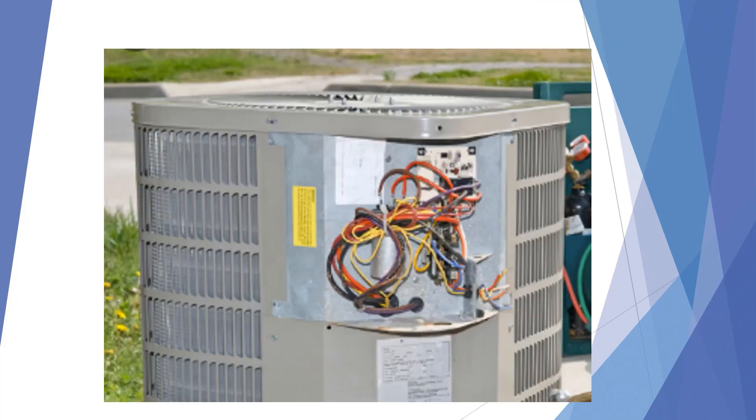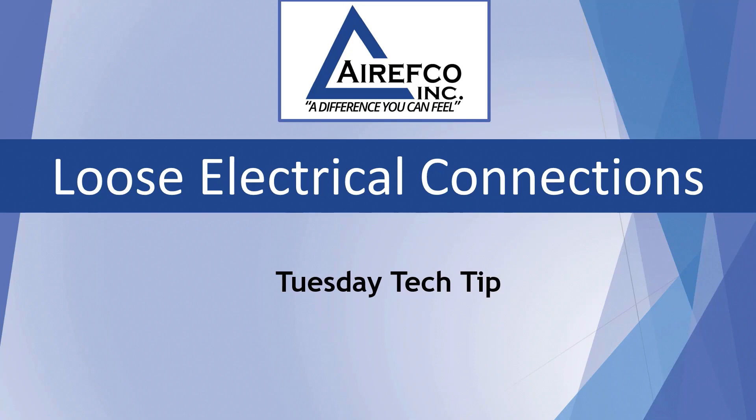As part of your proper startup of equipment, you want to include a final wiring check in your startup checklist — run your hand across all the wiring making sure all connections are tight and secure. When running power wiring into a terminal block, make sure all connections on that terminal block, the ones you make plus the ones made at the factory, are tight and secure. Yes, it is the factory's responsibility to tighten all connections, but they do make mistakes from time to time, and it is also part of your proper startup to make sure all their connections are tight and secure so you will not have cases like we have shown you in this video. Go to arefco.com for more videos.